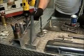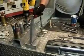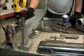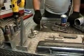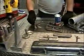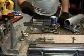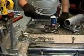You can mix up dissimilar metals as long as they're non-magnetic. Use it on non-magnetic materials with the exception of stainless steel. It will not adhere to stainless steel. One metal that it does weld is galvanized steel. That's the only magnetic material you want to use it with.